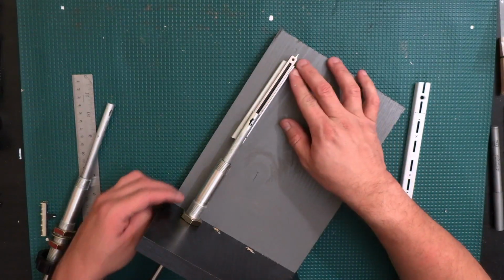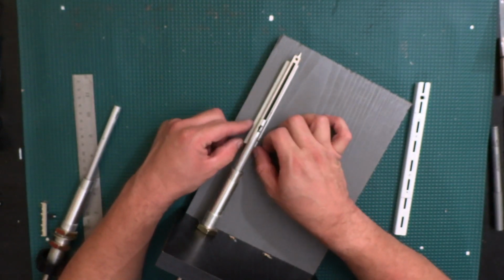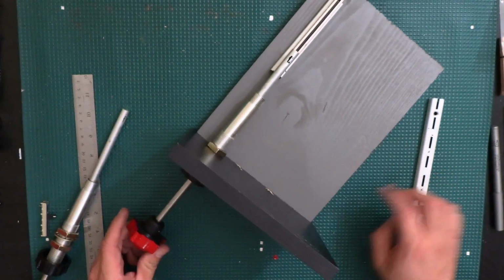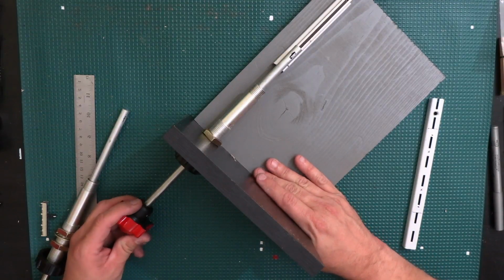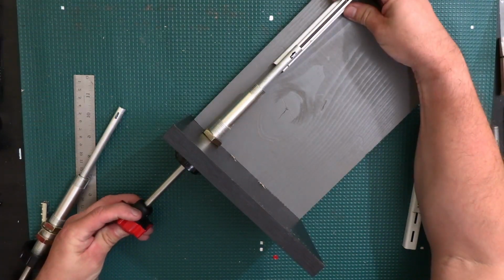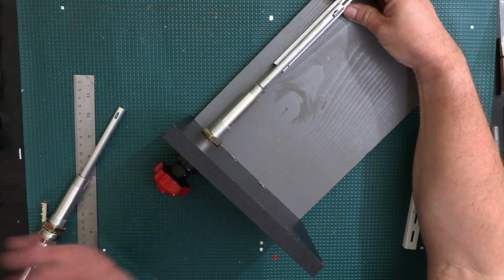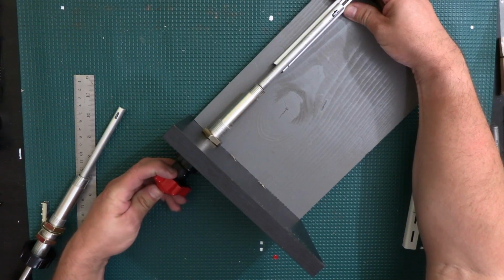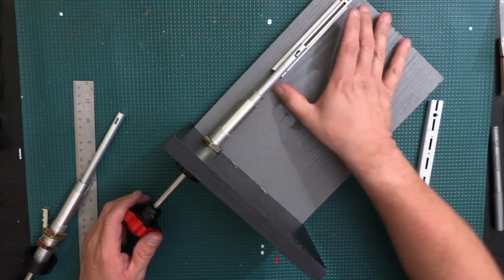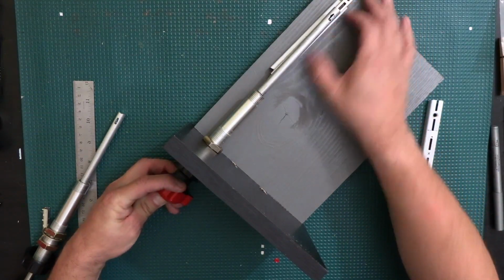I need to figure out exactly where I need to have it, so that when I go, and actually I don't even need to go full out and full in. I think I could just go out as far as I need to. So maybe I can just do, like, maybe 3/4 of the way out, and then you can go all the way in. And you can adjust in SimVim Cockpit the range of any potentiometer, so you don't have to use the full range. So you just got to make sure that it's kind of lined up so that it doesn't stress it. It has to feel pretty smooth as you're going through the motion here. That looks pretty good.